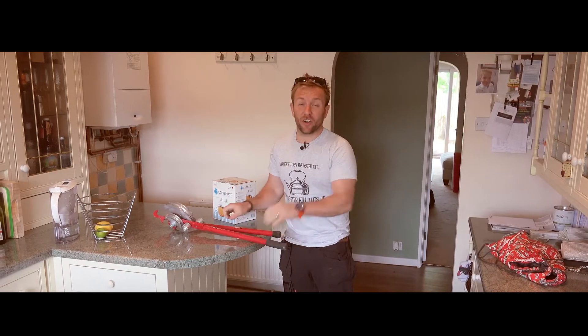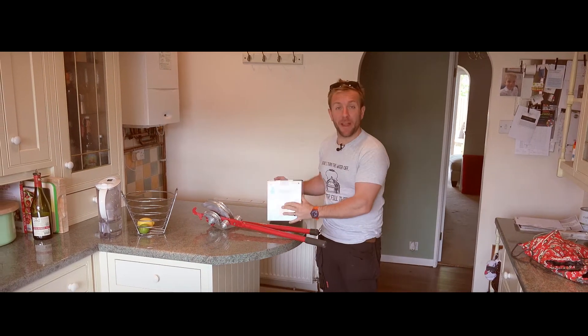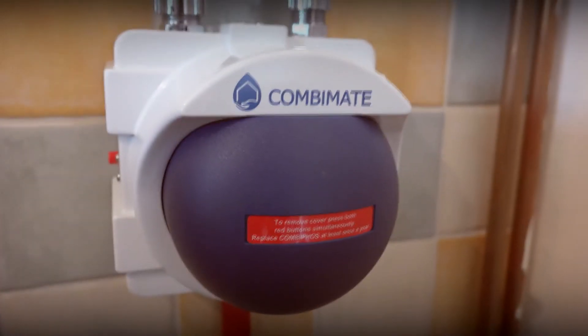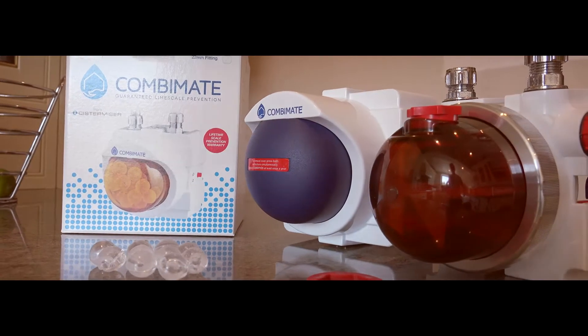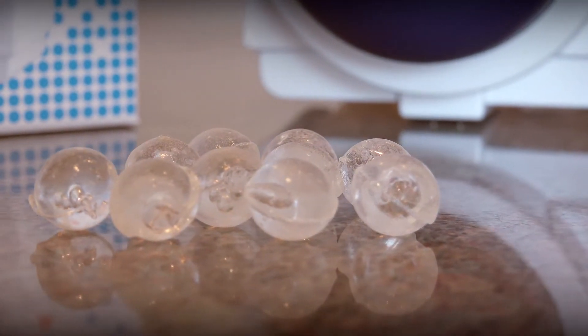Today we're going to be looking at a cost-effective solution for your combi boiler if you're in a hard water area. We're going to be fitting this CombiMate on this combi boiler. How they work is they attract the hard water like magnesium and calcium particles and coat them so they don't actually cling to any of the internal components of a heating system. This is especially important if you've got a combi boiler like the one we've got here. They've got what's called a plate heat exchanger in them, which means the waterways are very narrow. If calcium and magnesium — effectively scale — can build up in those areas, you're going to get a problem with the plate heat exchanger sooner or later. What CombiMates do is completely eradicate that problem in a cost-effective one-stop-shop solution.